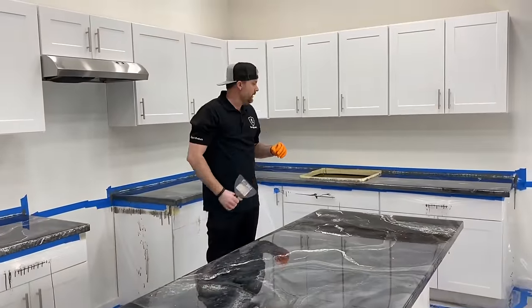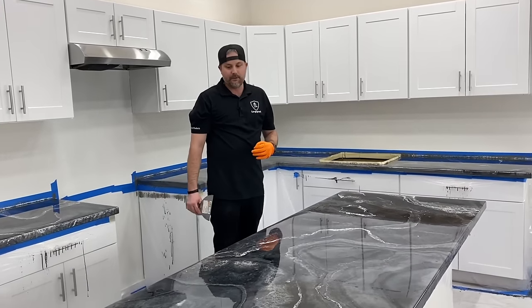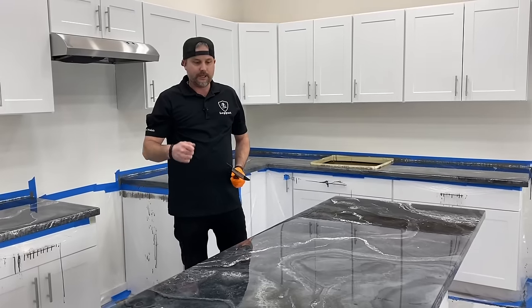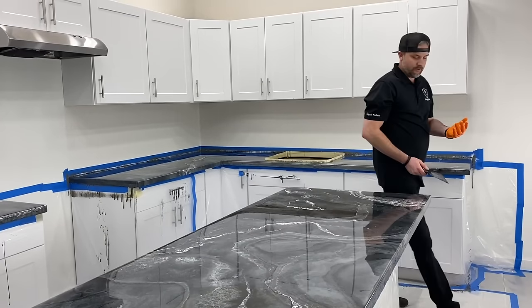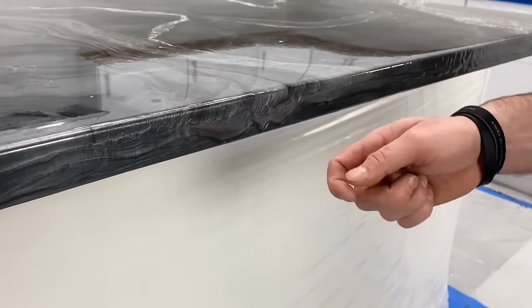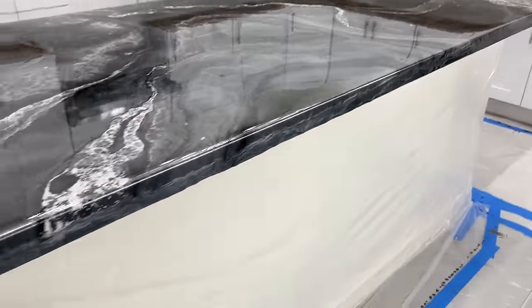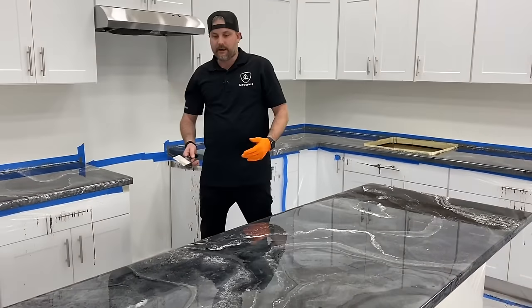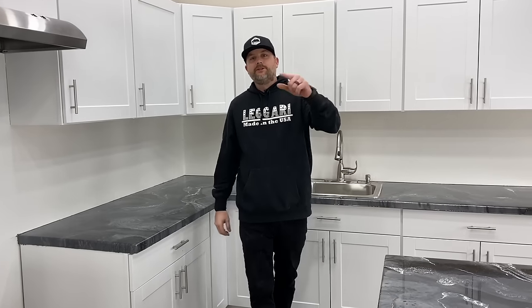Let these flow over and periodically check them — we don't want to walk away and assume everything's going to be good. Maybe you pulled the tape too late and the resin isn't going to flow all the way over. There are ways to touch that up with a paintbrush — get a little white color if there's a white vein there. Other things to watch: we don't want the edges to look like it's running. If it's setting up and not really dripping, try to brush that in with a paintbrush and blend it up so it doesn't look like it runs. That's pretty much it — let it do its thing, flow over the edge, and come back periodically to scrape the drips. Pretty simple process. One of the easiest countertop kits on the market — simply pour the product out, self-levels, self-marbleizes, no torch needed. Seven days fully cured.